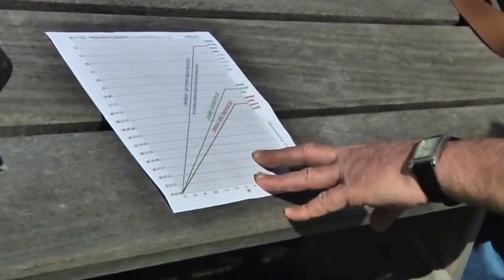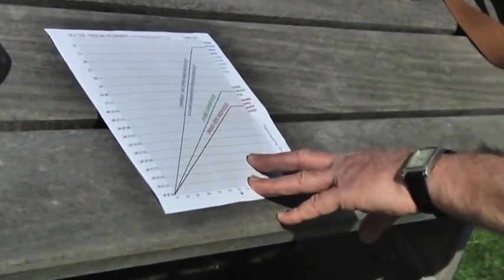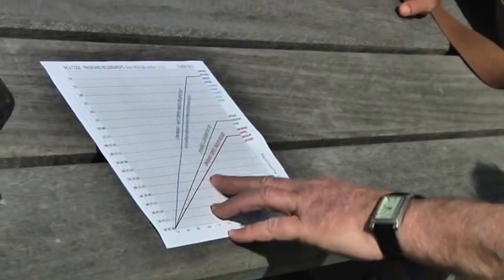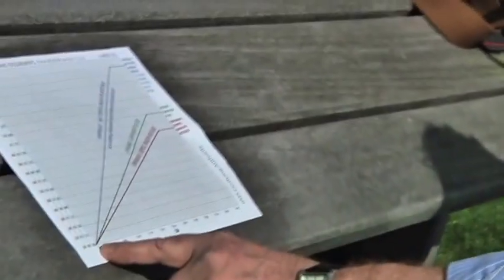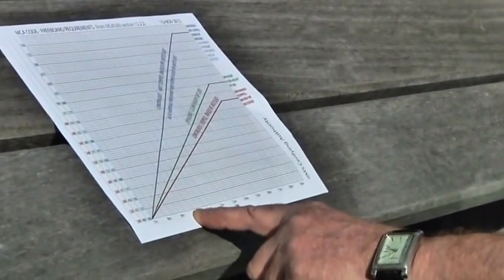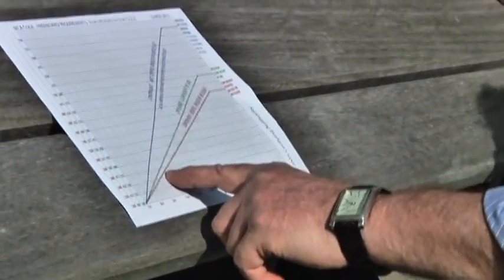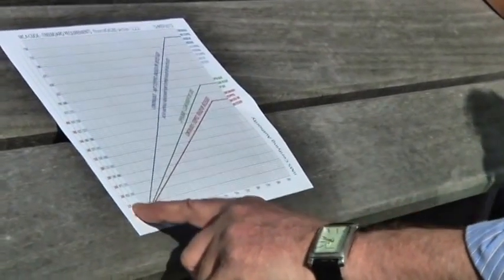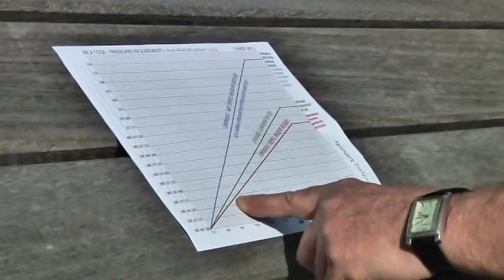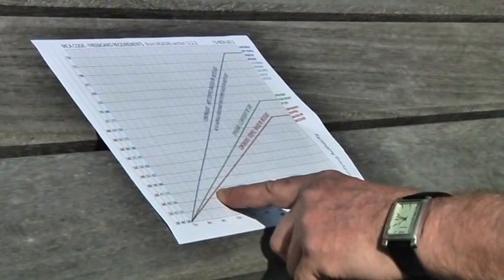With one further little bit to trip you up, which is that you can see just by looking at the graph that the red line for, let's pick a 10 metre boat for talking purposes, the red line obviously has a much lower freeboard requirement of about 255 millimetres or something than the blue line, which would be coming in at 425. So why would it be logical that because a boat's got a step deck that it should simply be allowed to have lower freeboard? It's not logical.